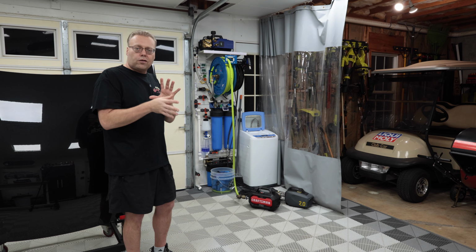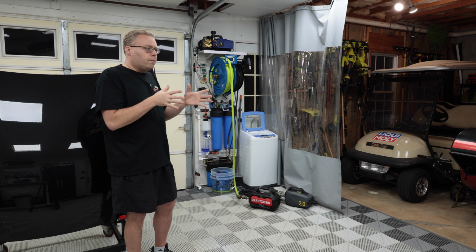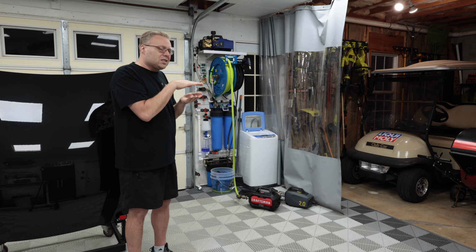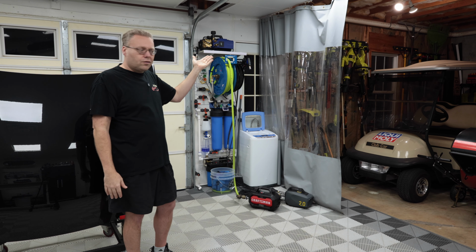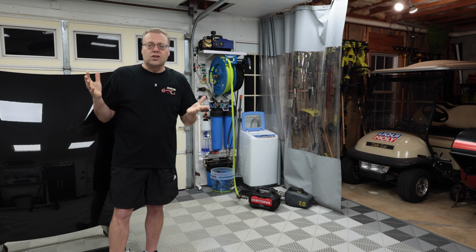So we can kind of know what the orifice does on that, what the amps do, the 2.0 as well, because the 2.0 kind of rides the line at 15 amps with the orifices and different foam cans. So we kind of see what it does there to kind of give you a suggestion. The 630 is going to run just fine on the 1.25 because it's a 20 amp machine, should be on a 20 amp breaker. So let's get into the soap being used.